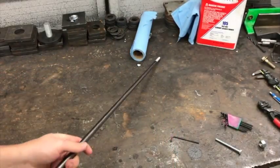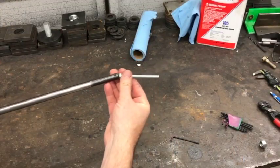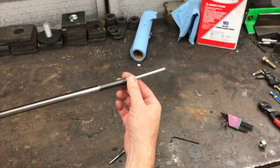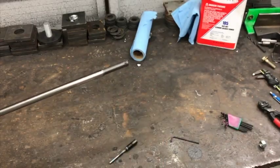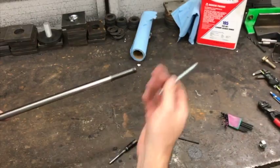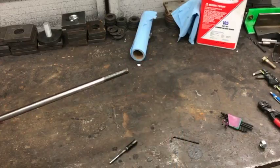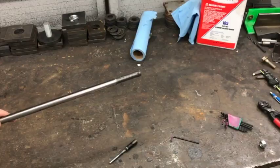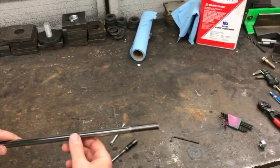Well, what he wanted to do was have a quarter 20 set of threads on the end like that. And he had a bolt, and I said, wait, I could just weld that up for you. If you want to bring it out to the shop, I can take care of that. Now, welding that on there, is that the greatest thing in the world? No. It would have been better to turn some kind of an adapter on the lathe that had female half inch threads that would come up on here and male threads coming out there.